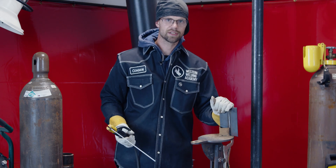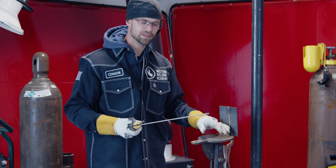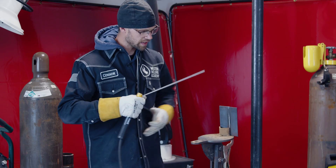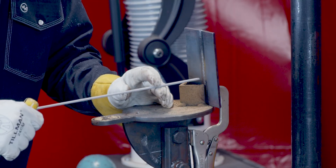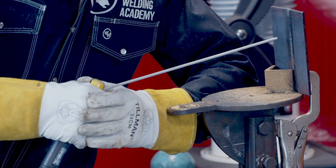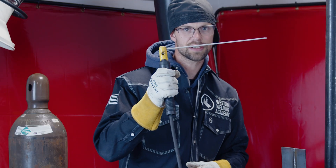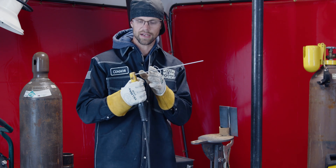Now in the 3G position, which can be really challenging especially since the bottom can run into things on the stands, there can be a floor in the way or it's just too high. My favorite way to weld in 3G is with a 45-up angle, keeping the rod really straight at 10 degrees up, keeping the arc length really tight. I usually keep my elbows really low and weld with my wrist, flicking back and forth a little bit. It's also okay to run the 90-degree position, though your hand may get too close to the weld and get too hot as you burn down to the end of the rod.